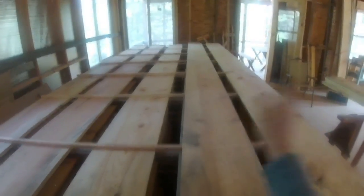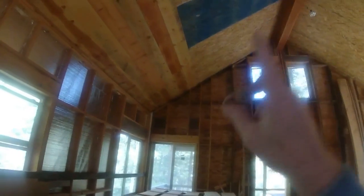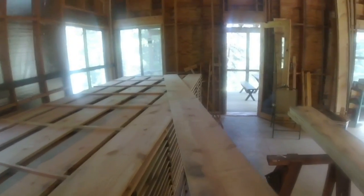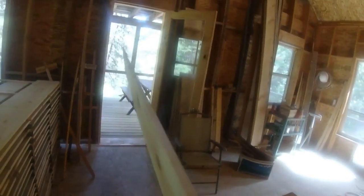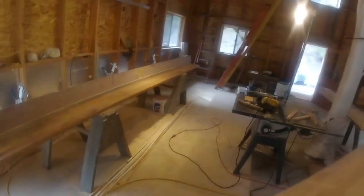As I dig down into my material stack, I'm thrilled with how flat these boards are. They've got some crook that I'm taking care of, but they're flat and beautiful — and that's because of the way they were stored. This sticker ventilation method works. Right after I got the roof in place, I bought this material at an auction. It had been unbundled — a couple of bunks that had been opened up and they weren't this flat. I got them cheap because they were crooked, then stacked them properly and they're in darn good shape now.